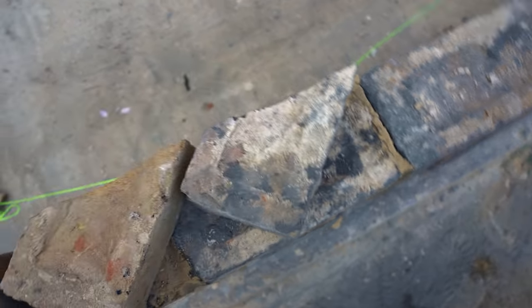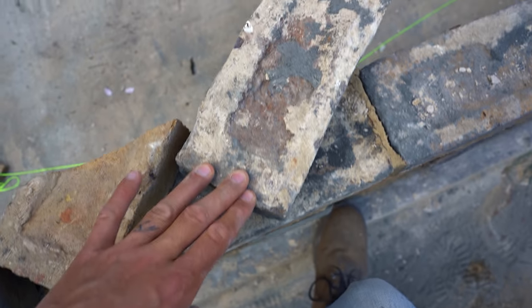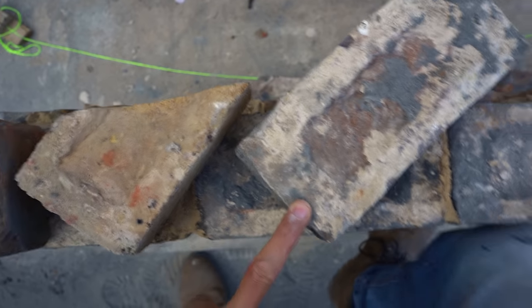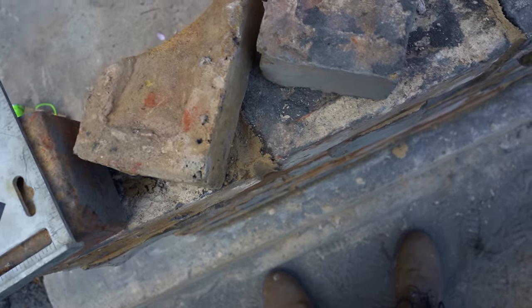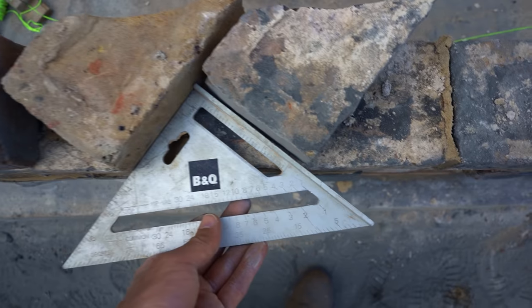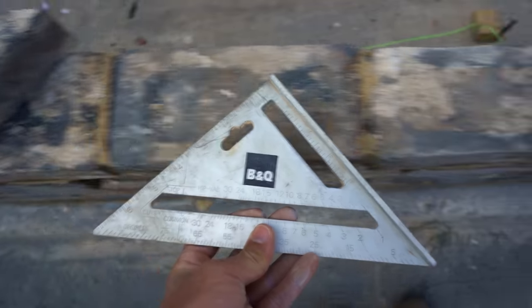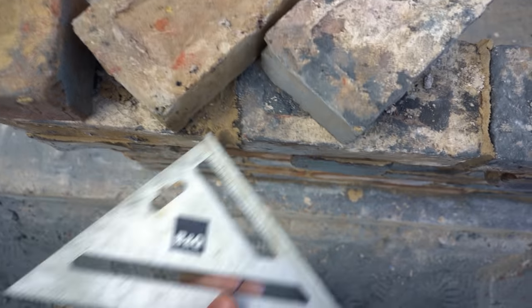Now what you do — imagine that this is a full brick, in fact I will do it with a full brick. Imagine I've done that routine with the square and this is all nice and squared up at 45 degrees. You take a pencil and mark a line along the back in line with the brickwork below, so you get a cut that looks like that. Once you have a couple done, you can make a template — a 45-degree square — and run that all the way along, which will get you exactly the same cut all the way through. I find using the roofing square a nice easy way of doing it so you don't have to make a template.